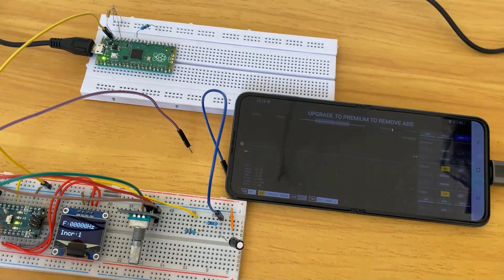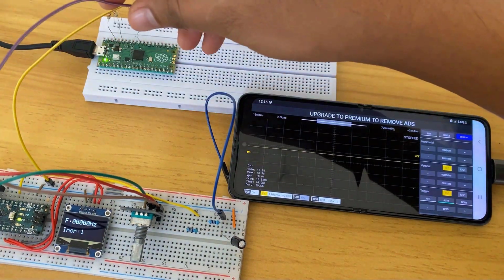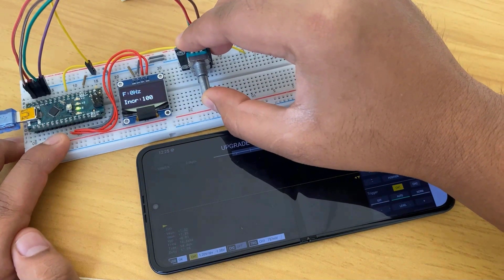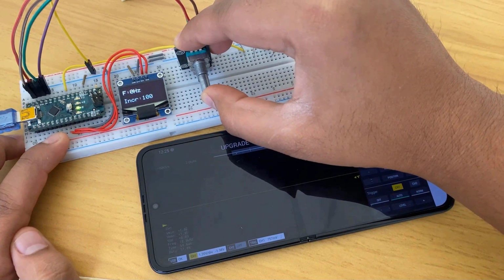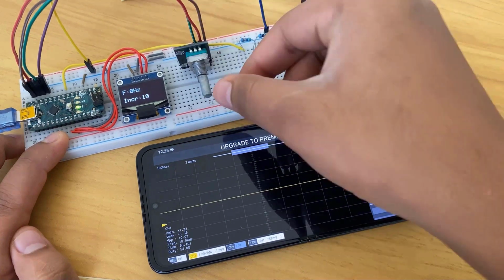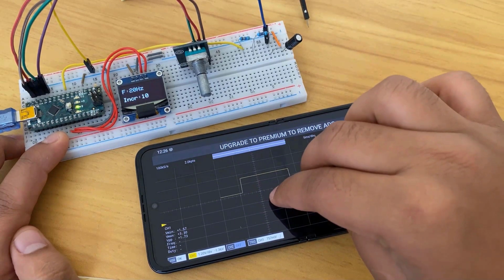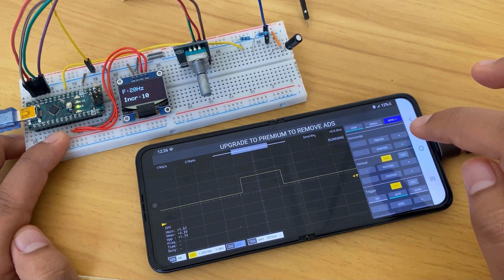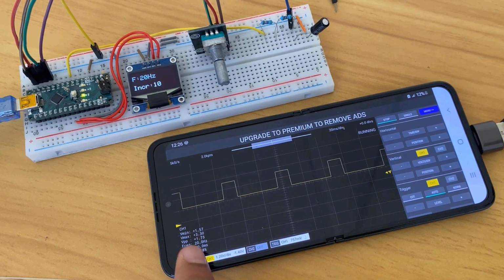To use this function generator, connect the output to the Pi Pico input. Use the virtual ground and also the V-in pin. When the button is pressed, the frequency multiplication factor can be adjusted. This means the frequency can be incremented or decreased by 1 to 1000 times. And to change the frequency, rotate the encoder. Now a frequency of 20 kHz is set and fed to the Pico. So a clear square wave is generated here. And when you compare the frequency, it's almost the same.